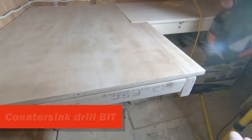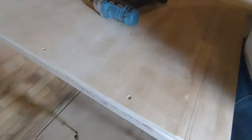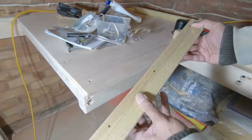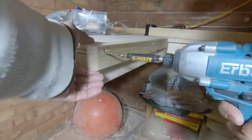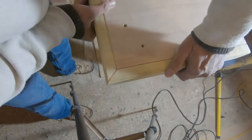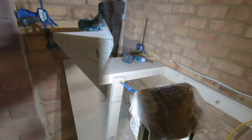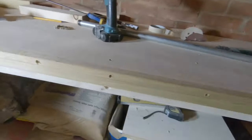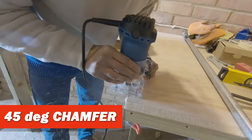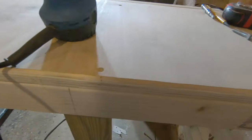With the workbench ready to be fixed, I used a countersink drill bit and drove in some 50 mm screws, doing the same on the 2x2 edge profiles. The corner gets a neat 45-degree mitre join. The basic structure is now done: the frame is against the wall, the plywood top is in place, and the lipping is there. I also used my router and gave it a 45-degree chamfer where the flip-top is going to be.